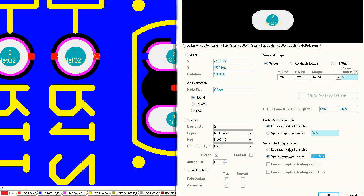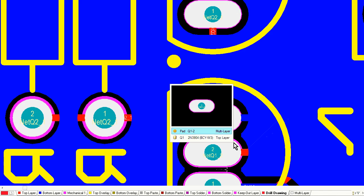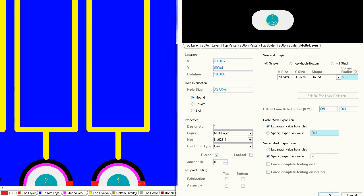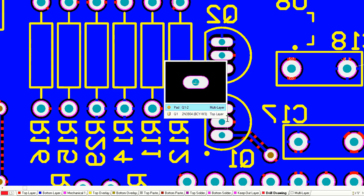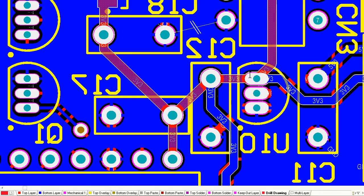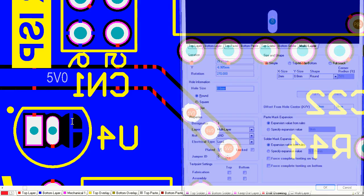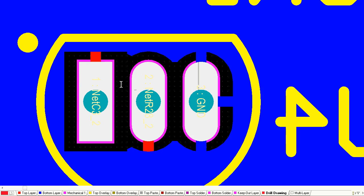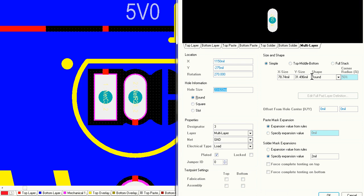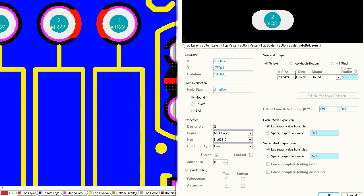I'm checking my solder mask expansion there. That's the pink solder mask expansion, to make sure there's enough clearance between each of those pads so that they're not going to break. In this case, for the transistor, there you go, I just narrowed my pad on the transistor. I wasn't happy with that footprint. I wasn't happy with the solder mask expansion on that. It would have broken through. Solder would short out between the pins during hand soldering or wave soldering manufacture.